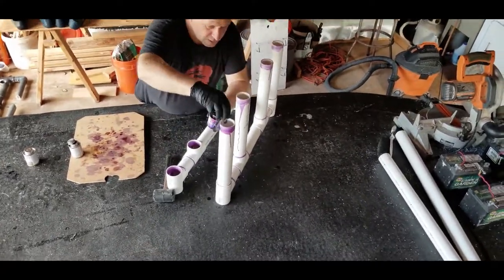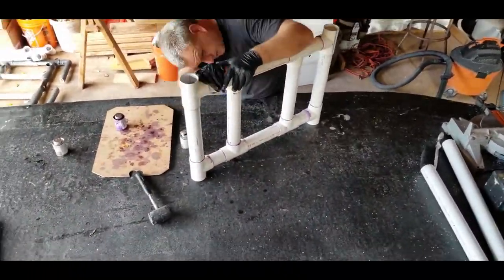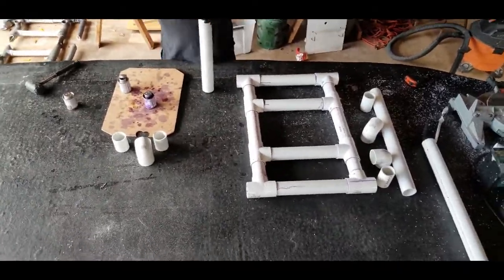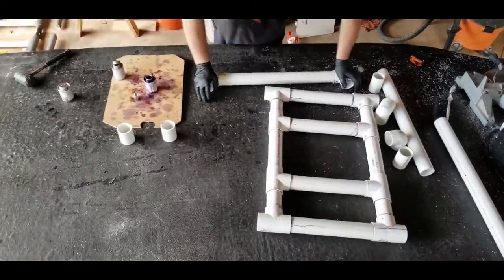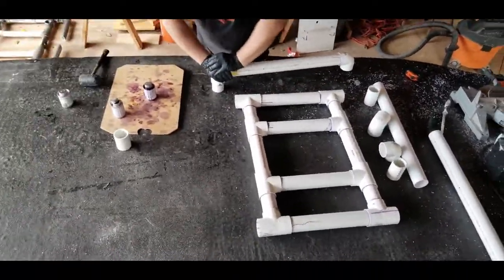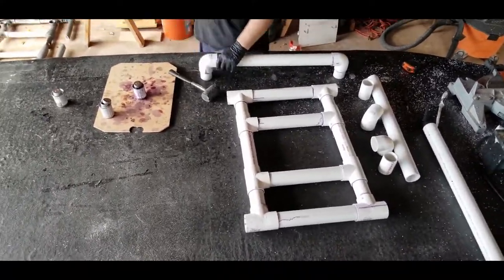Make sure that all of your pipes seat all the way into the base of the inside of the connectors. If you look inside the connectors there's a little rim where the PVC pipe will go all the way in and then stop or seat into that rim. I'll use a little rubber mallet — you can see it at the top left of the screen — to pound the end of the pipe cap, or I'll just pound it on the table. You want to make sure the pipe is compressed hard enough that you can feel it hit that ridge and is pushed all the way in so it seats properly.